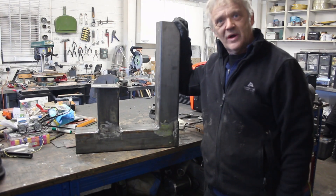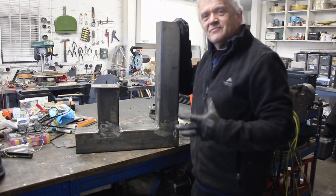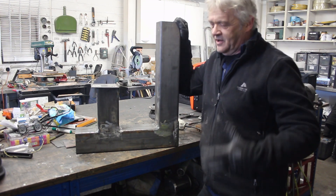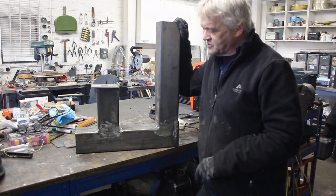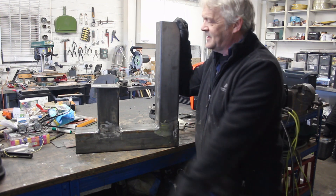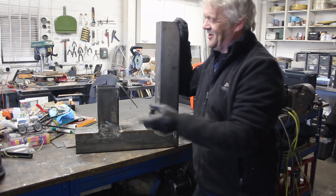That's the basic shape welded together and I've kept those ratios — that's 300 and that's 600, and that should be 150 but it's clearly bigger, about 250. I've read loads of things and they all tell me that really doesn't matter. There's lots of advice on pipe size too, with 7 and 8 inches being preferred — there's loads about gas flow. Chimneys vary between 4 and 8 inches, so I haven't got a clue whether the size is critical or not. I also read somewhere to put a lid on it.